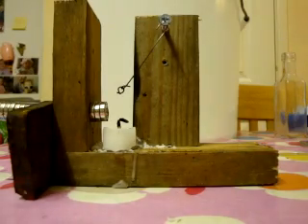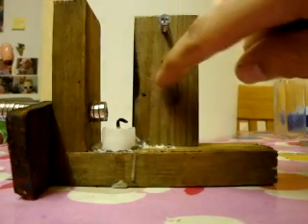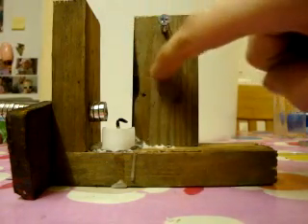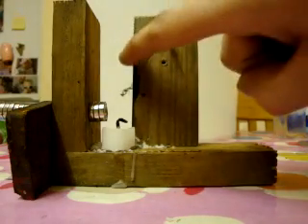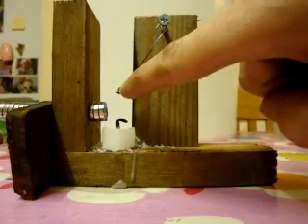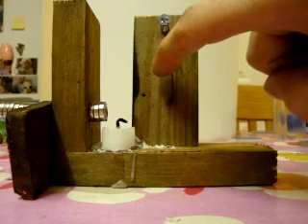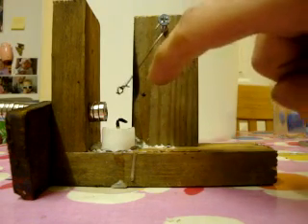So I've got the magnets set up. Now it's set up correctly, you'll see what happens. When this is down, as soon as you let go, I want it to ping towards the magnet. Then what will happen is obviously the candle will heat the metal, the metal will change its crystalline structure, it will lose its magnetic ability and then it will fall down. It will cool down and then it will become ferromagnetic again, and then it can go back up again.